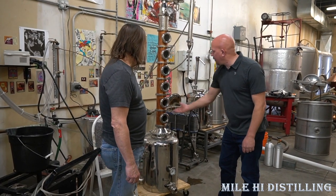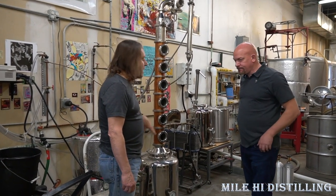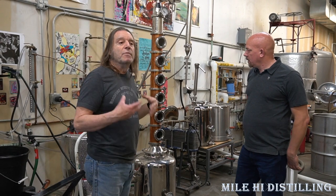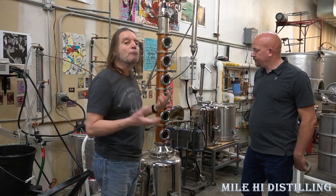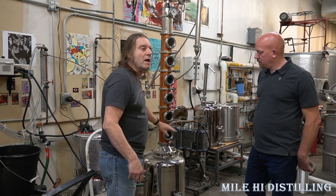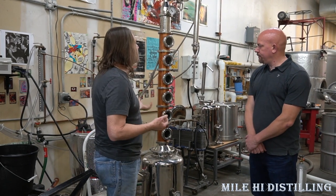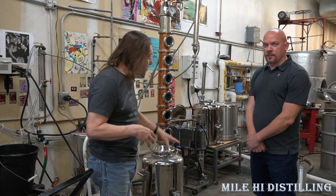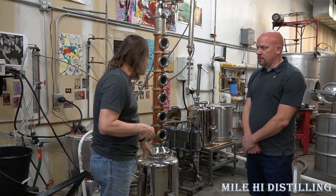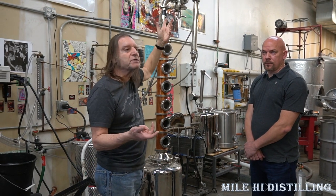The spirit is heated and the vapor goes up through the still and through the gin basket or infusion chamber, through the condenser, and out. The way we have it set up today, we actually have all the bubble plates in each one of these, because we want to make a really neutral spirit. If we wanted to make a spirit that wasn't as neutral, we would take out maybe every other plate — because that's going to strip out the flavor. Today we want a more neutral spirit. What's really important is we want to make sure the spirit we're using down here isn't going to conflict with the botanicals up there.